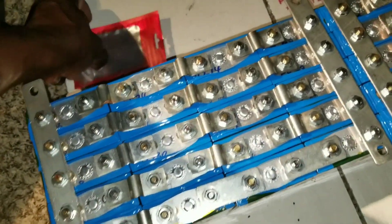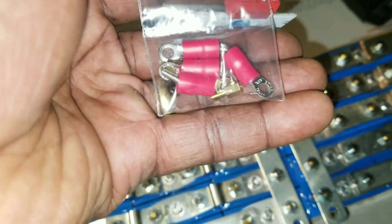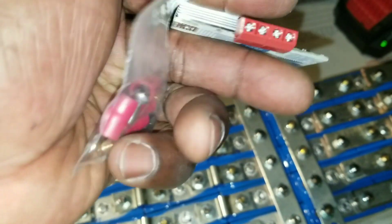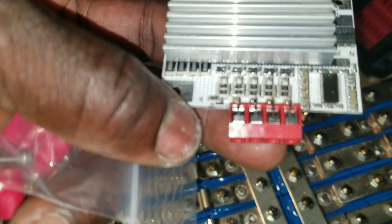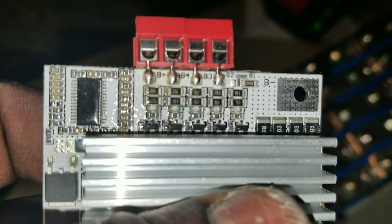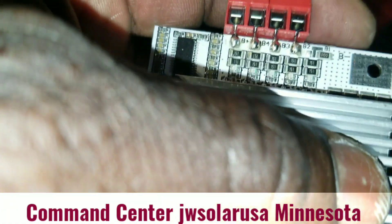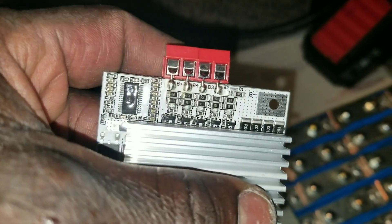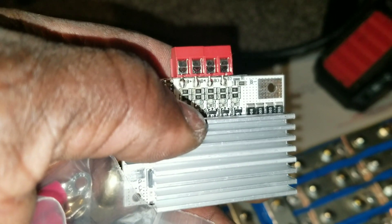Let me make myself clear — what I mean by going about it is wiring your BMS. Your BMS has the leads right here, or the terminals. I'm able to wire this one — that's going to be the wires going to the batteries. And this one is going to connect right here. I've been working hard today to put this battery in place — you can tell. This is the B1, okay. Let me flip this. B minus right here. So I can use one of these terminals here — B minus, and you see B1, B2, B3, and B4 right here, that's the B plus.